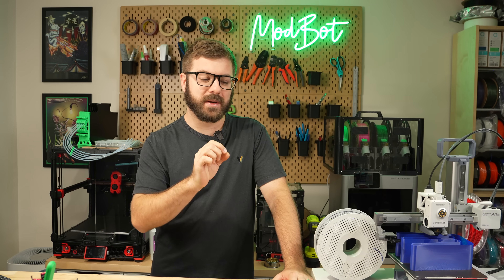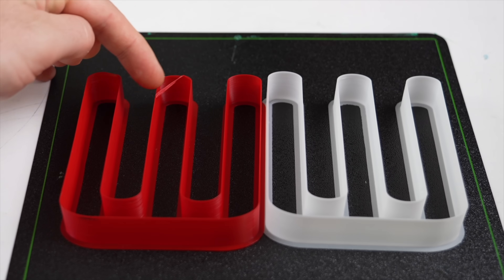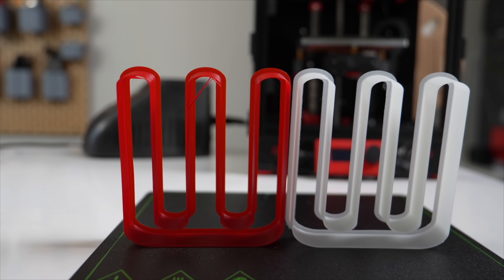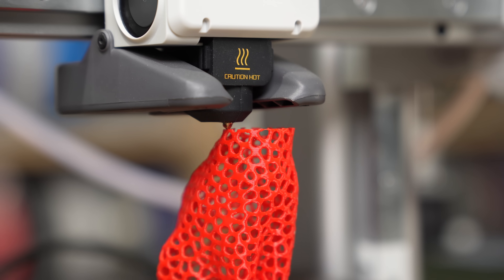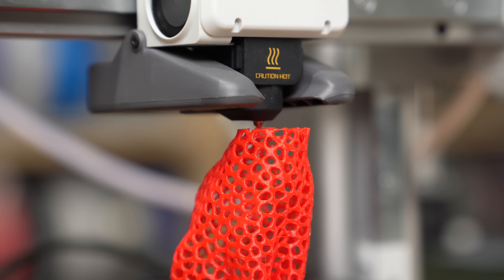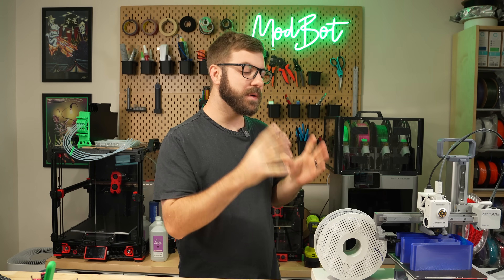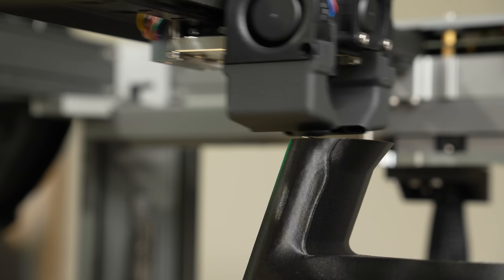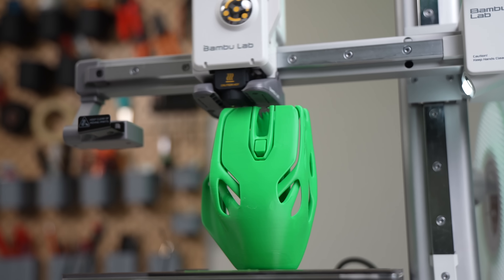Based on the test results, I'm happy to see that the high-flow PETG seems to be just that. A 33% jump without any other changes in flow rate is the biggest I've seen. However, due to the difference in mechanical properties and some hits to bridging and retractions, I really wish Bambu Lab was keeping basic PETG. The biggest hit is in impact strength, which is rarely something I'm too concerned about for the parts I print, but with 3D printing being such a diverse technology used for so many different applications, I really think the best solution would be to offer both the basic and the high-flow PETG.